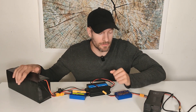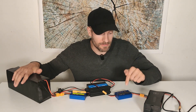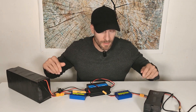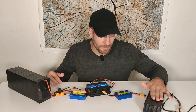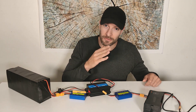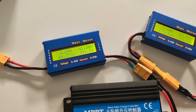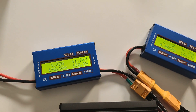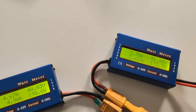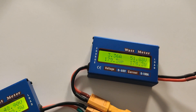I don't want to charge all the way up because I want the battery to last a little bit longer. This is lighting up because it drains some voltage from the battery, and in a second this will start charging — and there we go. I'm going to move the camera so you can see what's happening. The one on the left is the input and the one on the right is the output. You can see the charger is supplying somewhere around 51 to 52 volts and 190 watts, and the output is 51.8 volts and around 175 watts.